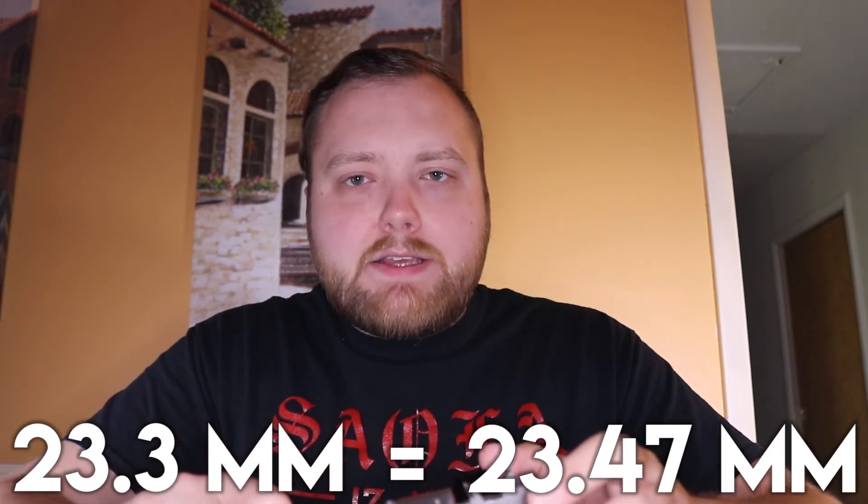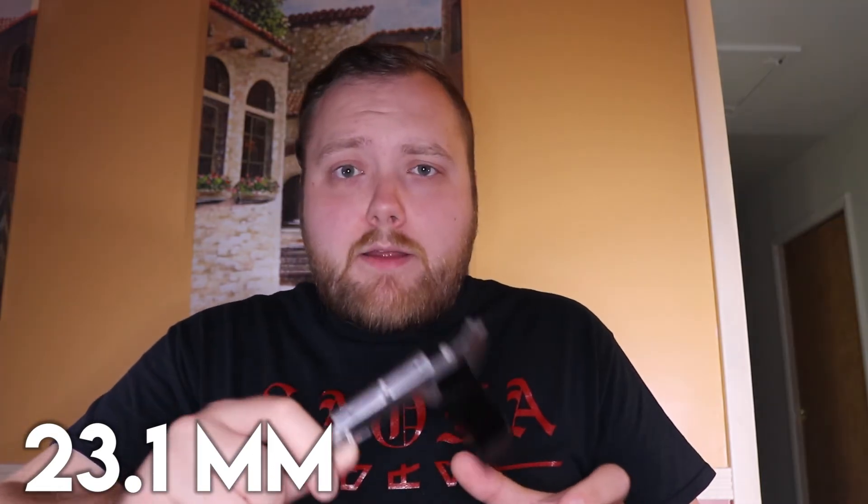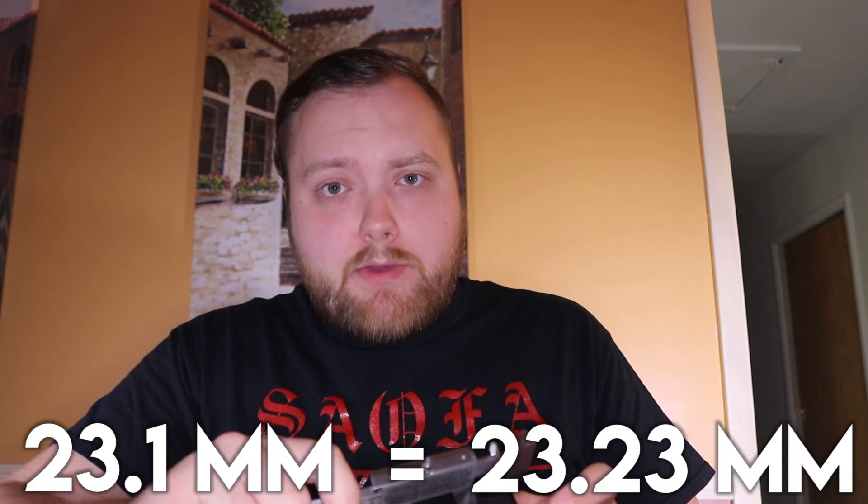So I took it down a few more notches. The third print I designed at 23.1mm, thinking I'd subtract a bit more. Even though the theoretical shrinkage rate of PLA suggests it should print shorter, in reality it's actually coming out a little taller than set. That one ended up printing at about 23.23mm. I then tried one more time, designed the part at 23.2mm, and that one ended up printing even larger again at 23.43mm.